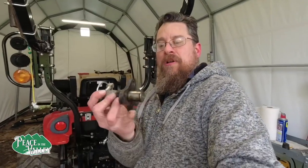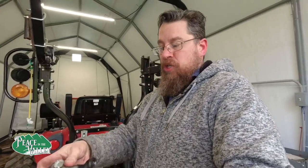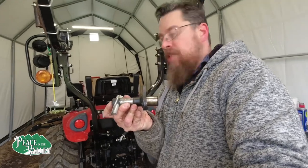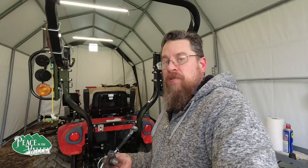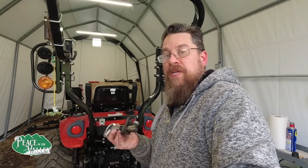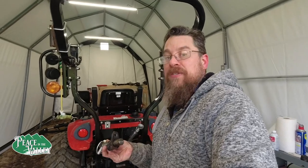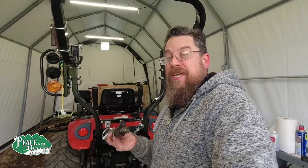Here is all that goes into the tractor. When the 3-point, which holds onto it by 75% of that post, and you only have an inch that actually goes into the cast iron with absolutely no bracing, that is way too weak. This is just the first, and you're going to be seeing lots of people have these problems. Because once we get through the first winter, which we are just finishing up, you're going to see that iron cracks when it's cold much easier. This is going to hit us, and it's going to hit a lot of people.